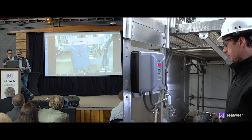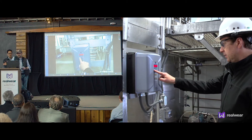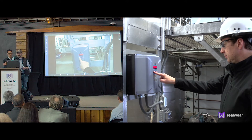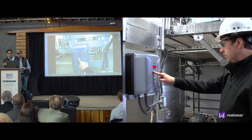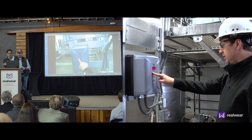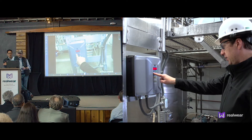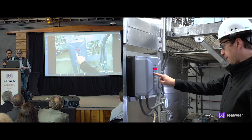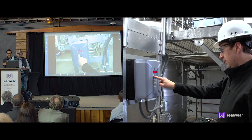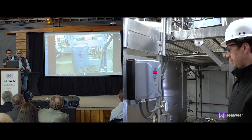We're showing 66 hertz. I want you to set that to 50 hertz. Go ahead and use the down arrow — if you hold it in, those numbers will go by very quickly. Five zero dot zero zero. Sorry, the memory isn't as good as it used to be. We might have to talk about some additional testing. You're almost there. Bingo! Go ahead and hit the program button.